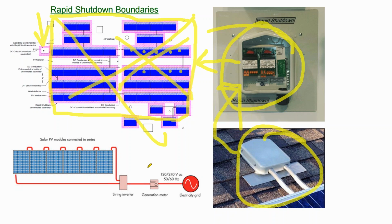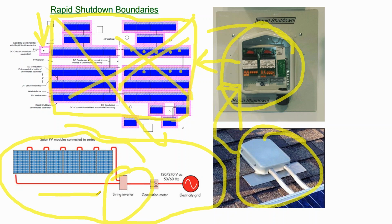It's kind of interesting, back in the day when solar was kind of dumb and you just had string inverters, and these string inverters were not the best at detecting maybe not a ground fault where the electricity is faulting to ground, but they weren't good at detecting another kind of fault called an arc fault, where maybe you have a connector that's not firmly made, and it's firmly made enough to transfer electricity, but it's jumping over some air and there's some resistance in that. It might just be dragging down your production a little bit. It's still an error. It should be fixed, but the old school inverters couldn't detect that.